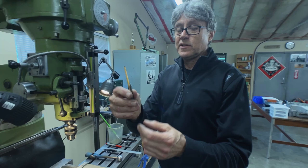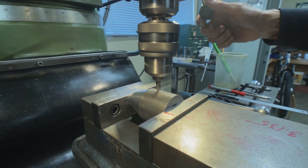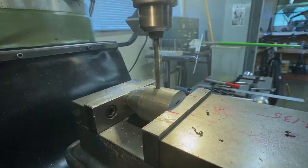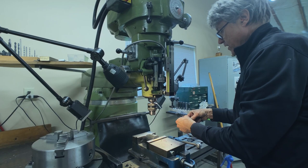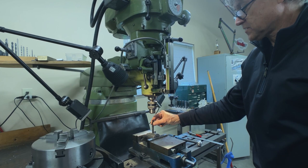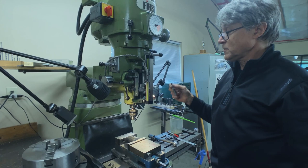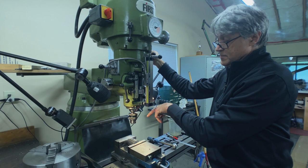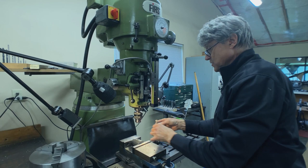Off to the mill now. We're going to use the mill like a drill press. We'll start out with a center drill — it's short and stubby, no flex. So that's the tap drill. What I could do now is take this out, hold that in the vise and get a tap handle and tap the hole, but I could be starting at a slight angle. So I'm going to hold this in the chuck, start up the motor spinning at a thousand RPM, then switch off the motor and bring down the tap as it's decelerating in speed to start the hole. And if it goes too fast, I've got the brake to stop it.